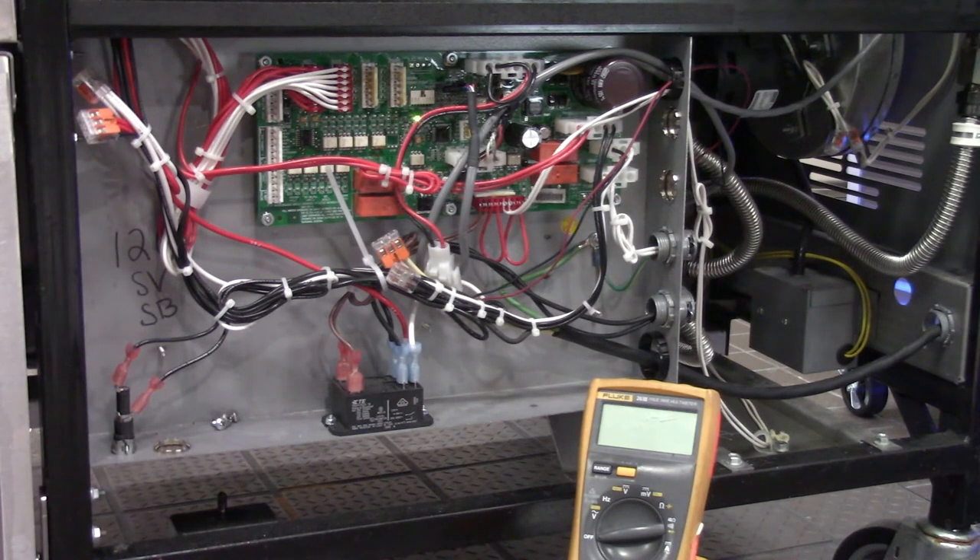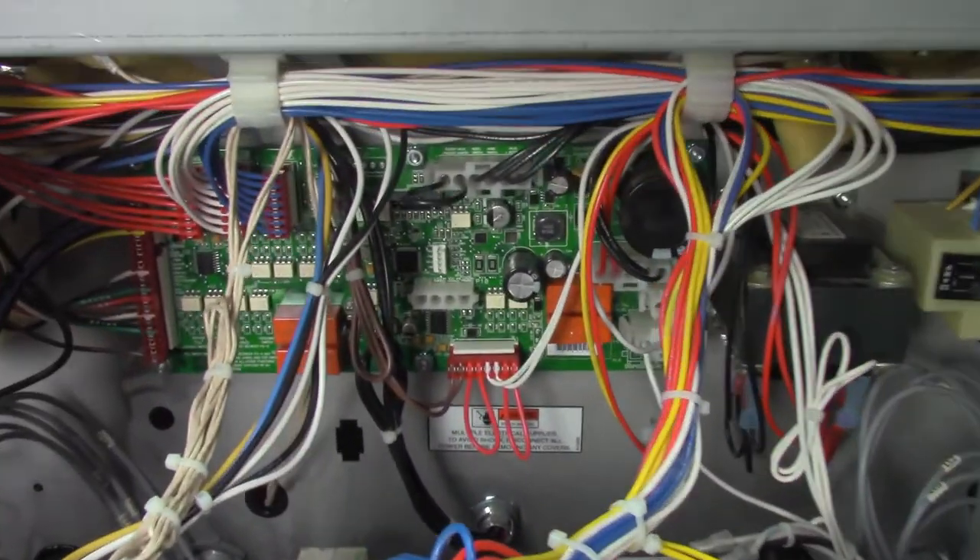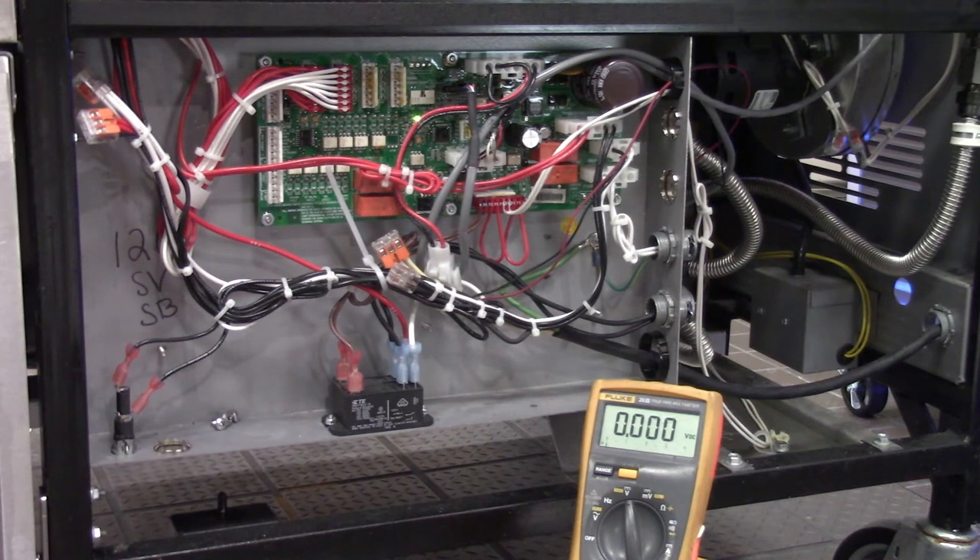After we've energized the filter pump motor in the filter menu, now we can check for our DC voltage going to our pump motor relay. Please keep in mind, pump motor relay and AIF board location is going to depend on which model we are working on. On Evolution Elite gas models, it will be behind the right side panel. On electric models, 200 series, that location is going to be behind control panel number two. On LVG McDonald's gas units for 200 series, the AIF board location will be on the inside, right next to our jib container, as LVG 200 series side panels are not removable.